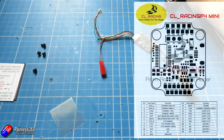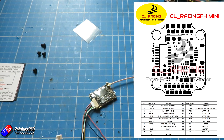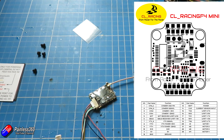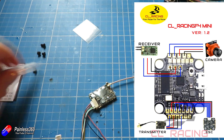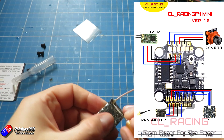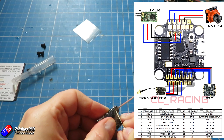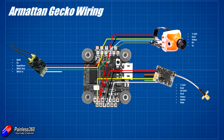The manual for this thing is pretty good - it's not really a manual, it's just a layout diagram. It's come with Betaflight 3.5 on it, which we had a look at in the previous video. Now what I need to do is just solder up and put a blob of solder on all the pads I think I'm going to need. I'm going to follow the wiring diagram I've created, with one small exception: I am going to power the Runcam Split directly from the mains, putting it onto the battery terminals on the power distribution board 4-in-1 ESC at the bottom.